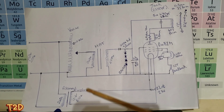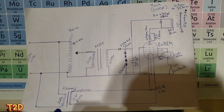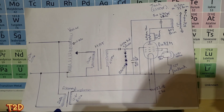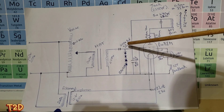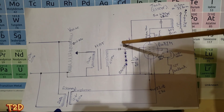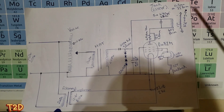That soft-start is omitted here but it's a good idea. This schematic is slightly different from what I've actually built - it's a modular build. I had the secondary and power supply already and put this together in less than half an hour because I had the parts. For the capacitor bank, I've advised four to six parallel caps but I'm actually using a 40uF capacitor because I had it on hand.